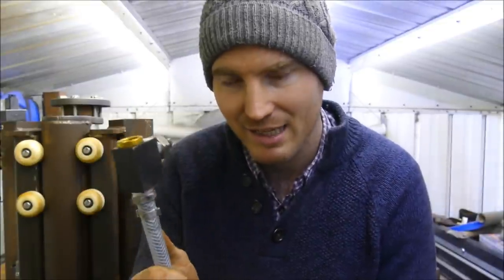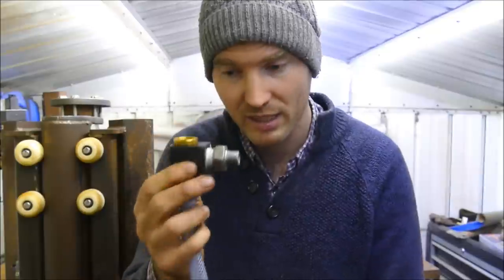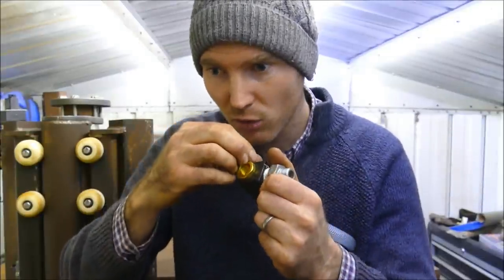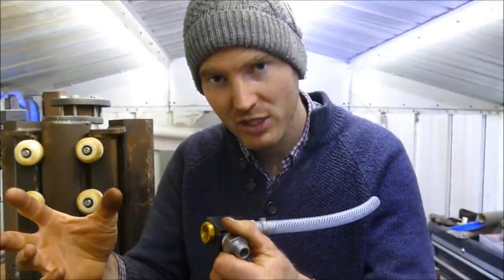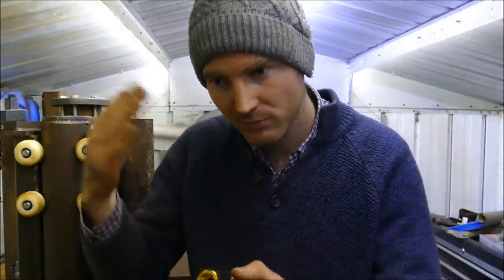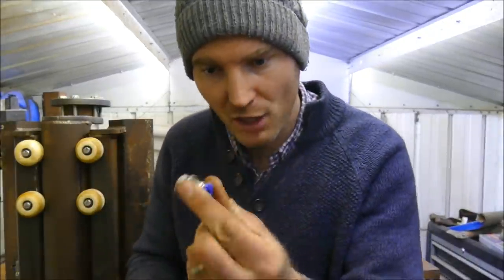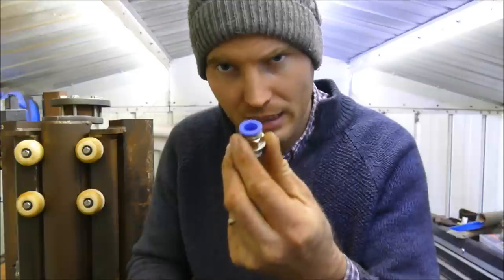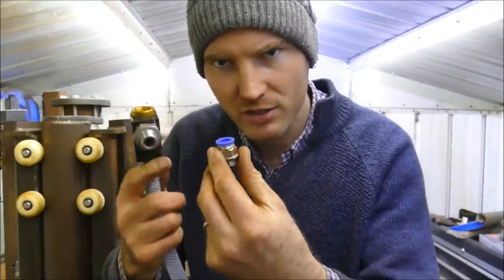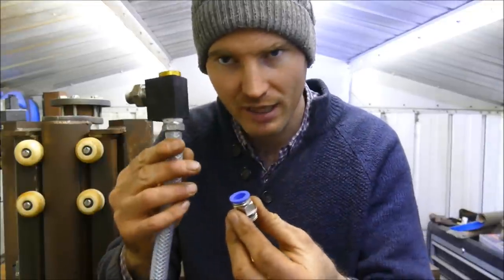And actually testing it without the quick exhaust valves, I think it still works absolutely fine. It might work marginally better with the quick exhaust valves because you're exhausting all of that air pressure within the cylinder at the source, so it makes it reciprocate more effectively. But because these are so expensive, I'd need more of them, so I decided to just lose these. One of those is the same price as one of those.